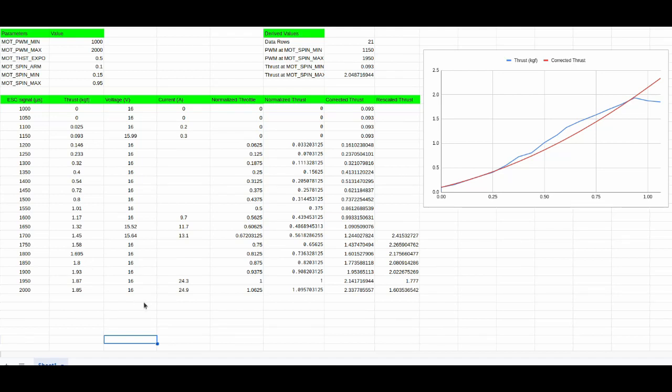You can find this spreadsheet linked from the ArduPilot thrust scaling page. I've entered in the thrust readings from the thrust stand. ArduPilot's model of what the thrust would be isn't a particularly good fit by default, so a parameter we can optimize is the thrust expo. If I increase that, we see it's a worse fit. So instead let's try reducing it to find a better number — something quite a bit more linear than the default seems to be a much better fit.